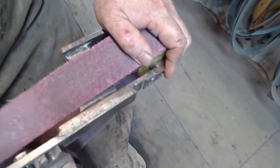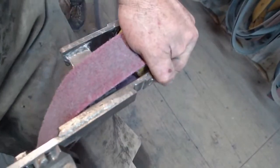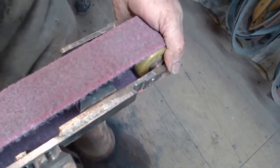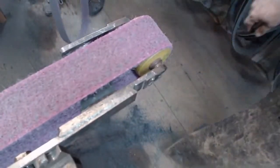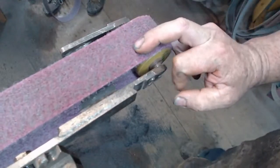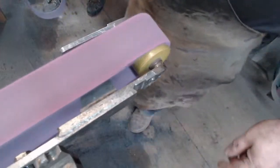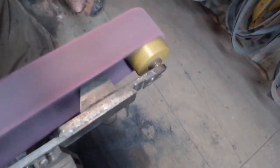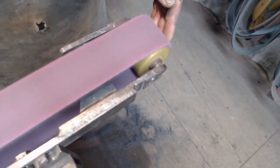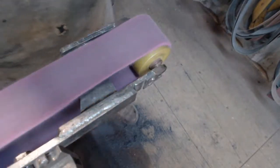So this is a medium, this is FEPA, South Africa. I get mine from them. They are fairly expensive, but they last years, man. They really do. There's some of these belts in my shop that are three and a bit years old. Now this one, if it rocks like this, it's normally an indicator that that join is busy popping. So get me a new one, please.